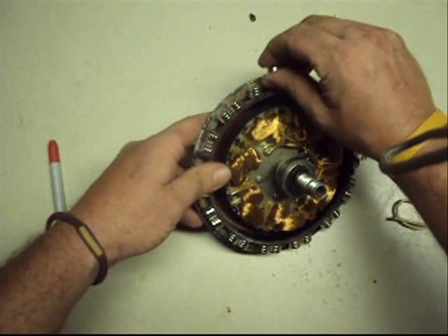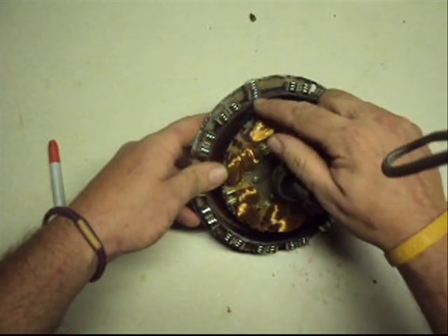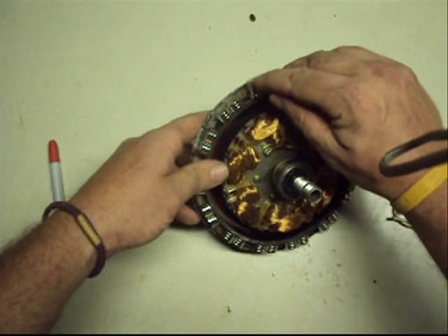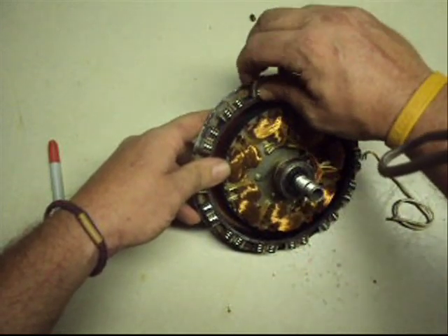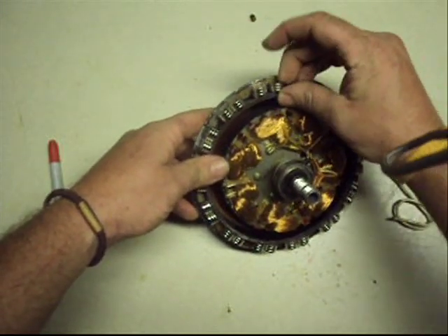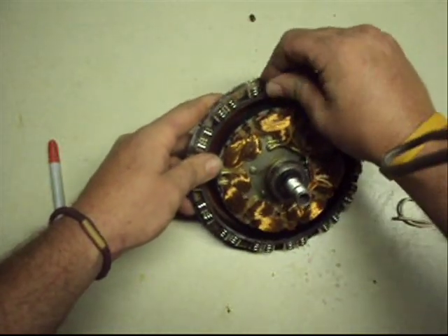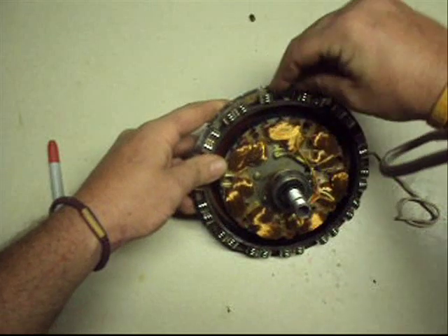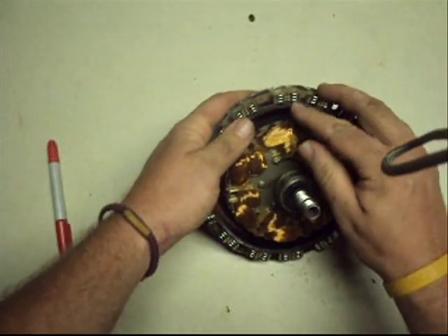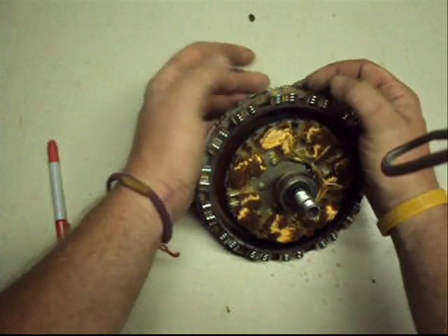From the path that this one wants to take — when you put this one down here, if this is north, this is north, this is north, or south going to north — all of these magnets are in the same polarity. If this is north then these all have to be north, and north repels north. That's why they want to do that. If I flip it over, I should have it the right way. There we go — north, south, north, south. That's why these want to come together.